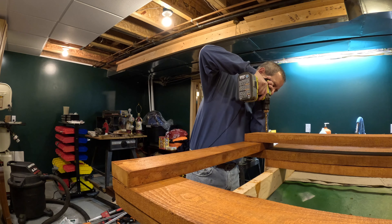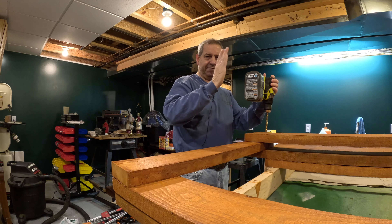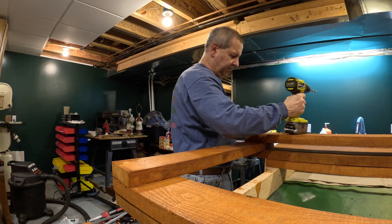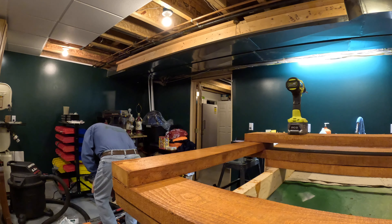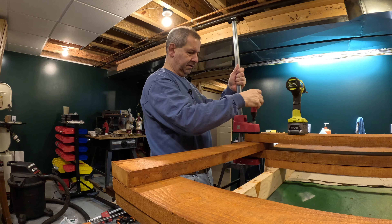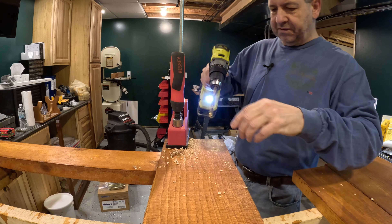Let's see if we can drill these straight through. I've lined them up so that everything will line up well once I finish drilling the holes — I won't end up with the bolt kicking out or whatever. Before I get too deep, I'm going to throw a clamp on here just to keep it from picking up when it gets down to the next piece of wood, at least until I get a couple bolts in there. My drill bit is probably a little bit short — I'll just finish drilling through once I get done with these holes.